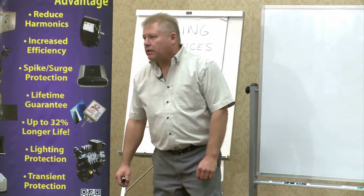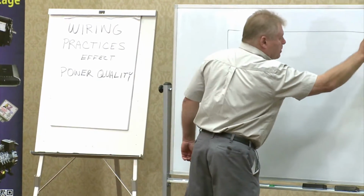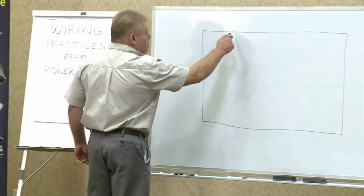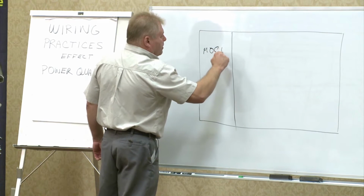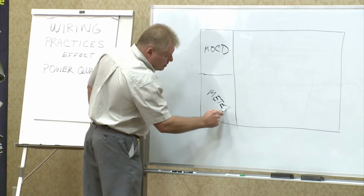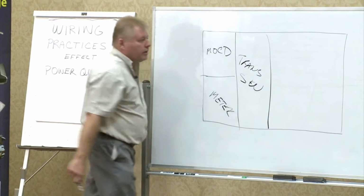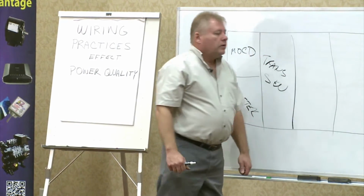It's patented. Okay? So basically in an electrical system, what does Clean Volt do? And that's the name of the product. We're going to take this, we'll call this a CDP because most of us are familiar with it. You usually have one cabinet where we have our main overcurrent device. A lot of them, this is where your metering is. Some have a transfer switch. And then whatever risers beyond that. So we'll make a two-riser system here.